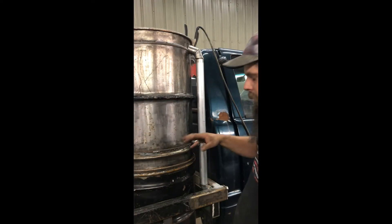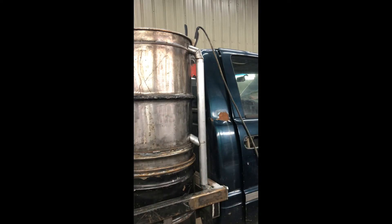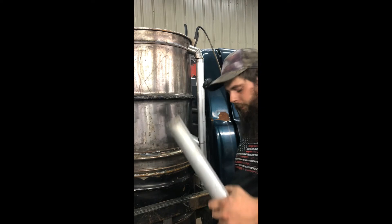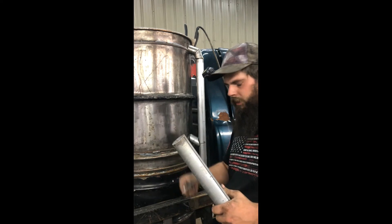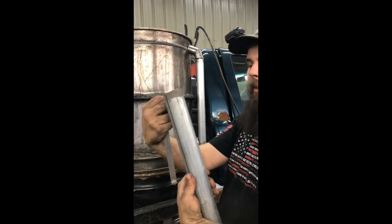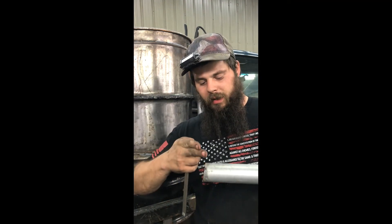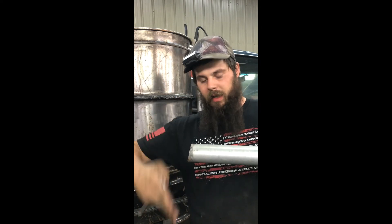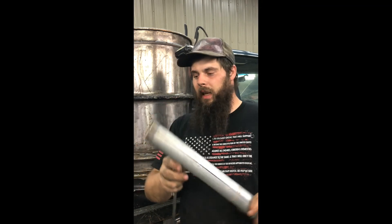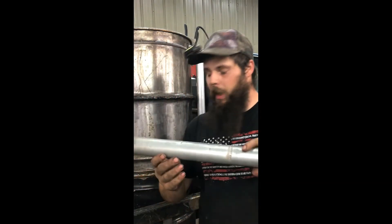You guys remember the trick I taught you last time? It was back on my build thread on the Toyota about jointing pipe to pipe — super simple. Let's say you want to joint that pipe to this one at a perfect 90 degrees. This is 48mm pipe, so we're going to divide it by three — one third. You're going to take and set your caliper to whatever that measurement is. Start with a flat cut, scribe a line all the way around. Now, all you have to do is set your pipe in a chop saw and just kiss that line at a 45-degree cut — that will take a slice off. Rotate it 180 degrees, take another slice off. That will leave you with two very flat small corner edges up here. It's so close to a perfect fit-up that it's actually weldable. But if you round the corners off just a little bit with a flat wheel, it works like a charm — butt it right up, easily weldable.